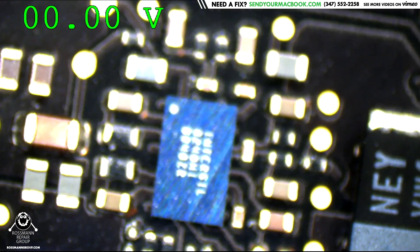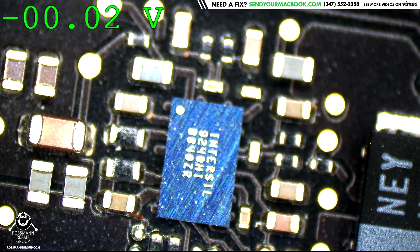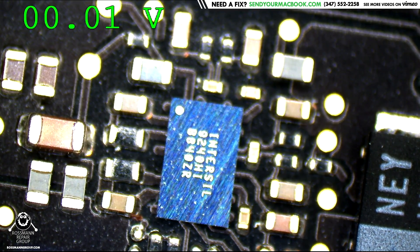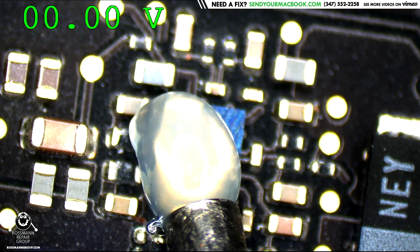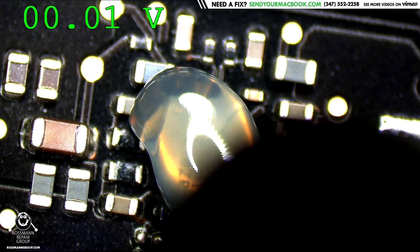So here what I'd like to do is give this chip a minor reflow. I'm just going to put the syringe for flux over it, put some flux there. And you're going to notice that right as I do that, there is an immediate crack evident on the bottom right of this chip. These are very, very fragile chips, and it's very easy for them to crack if there's any sort of drop or shock to the machine.